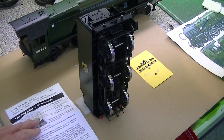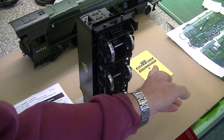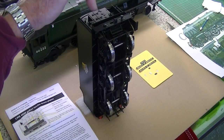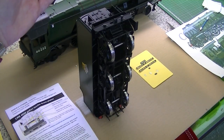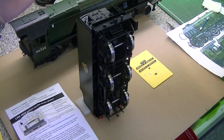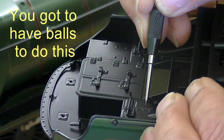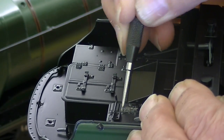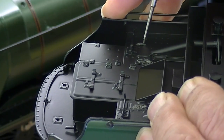Now we have our plans from Mr Lithgow to show us where the plates are going to go on the tender inside surface. We've got the plates already pre-prepared. Now we've got to prepare the tender because we don't just stick them onto the paint — we've got to scratch the paint away and get down to the metal. How strong do you want your plates on? As strong as paint, or as strong as bonded to metal? As it so happens the positions of these plates are marked on the fine scale brass loco. Scratch through the paint to the metal to make a nice keyed surface in the three locations.